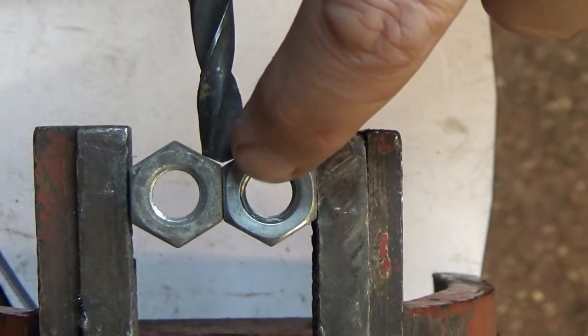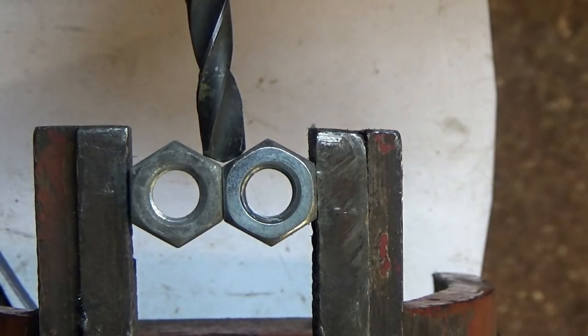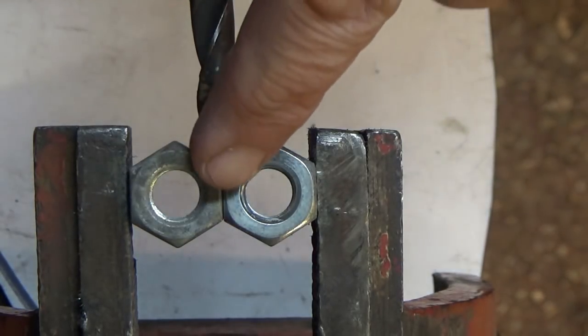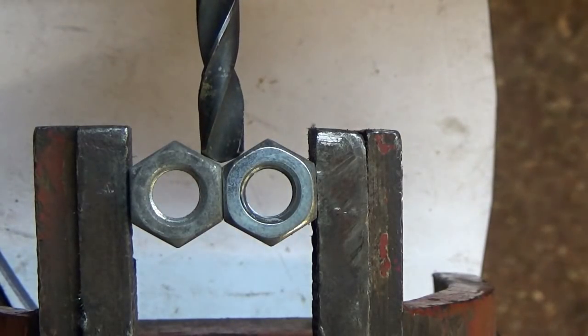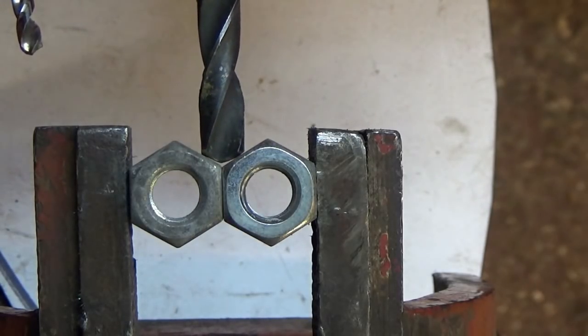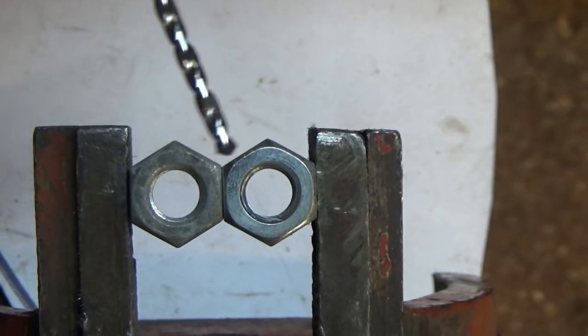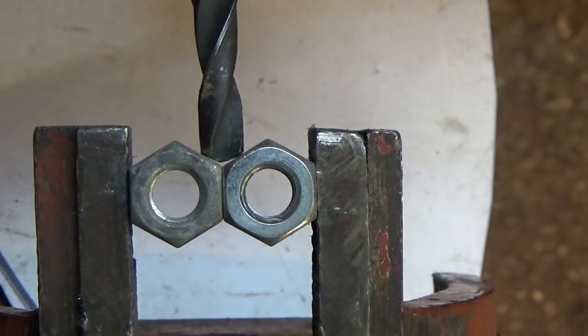You can see there's all this light in between. If I line it up straight, this angle here is not running the same as this angle there - that's how the gauge works really well. What I'd have to do in this instance is take more material off this side, even them up, and then I've got one of the two pairs of angles I need to worry about done. So I'm going to give this a quick sharpen and then we'll talk about the second set of angles.